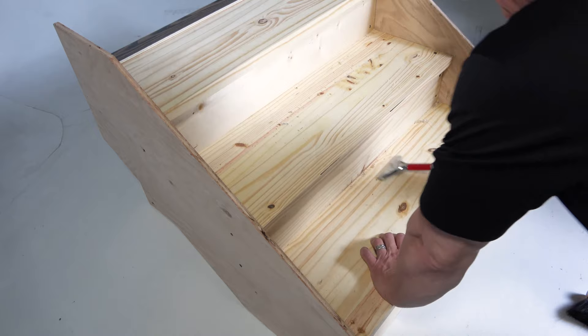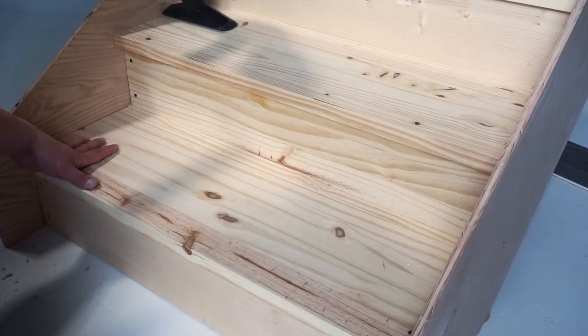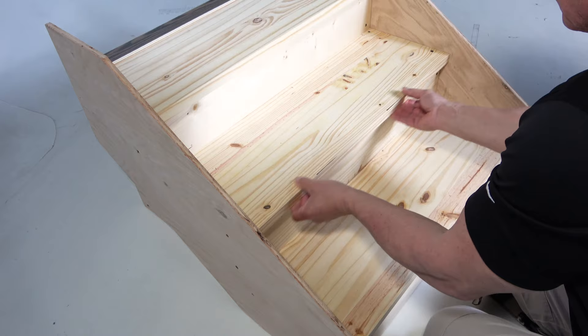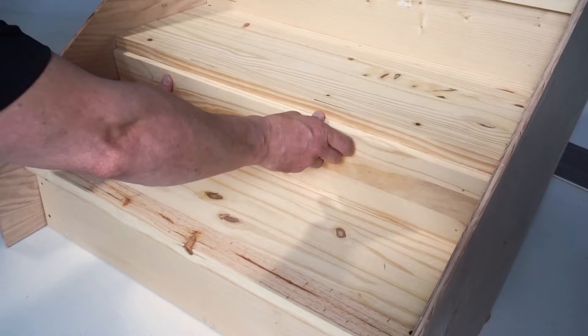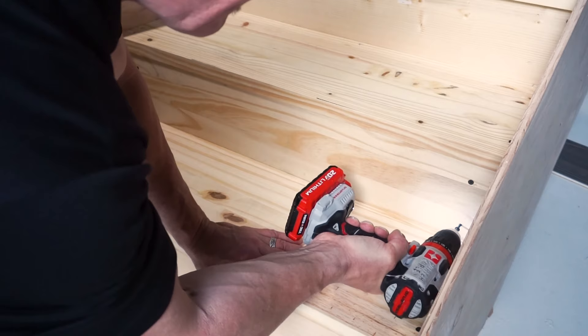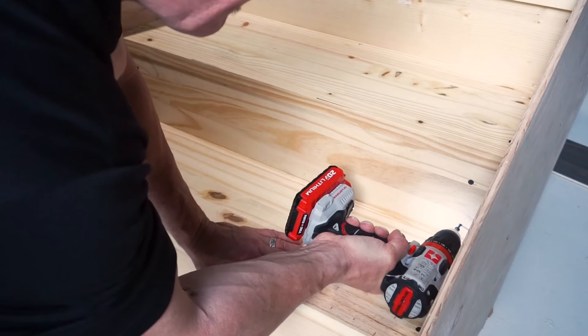Before beginning, it may be necessary to remove any staples, nails, fasteners, or adhesives. Make sure you sweep and vacuum all steps and risers and assure that all areas are clean, smooth, and structurally sound. Flush stair nosing requires that the riser be flush with the step edge. If your steps have an existing overhang, you will need to make some modifications by either cutting off the overhang or filling in the area beneath it. Any modification should be in compliance with local building codes.